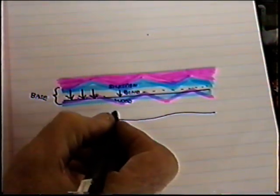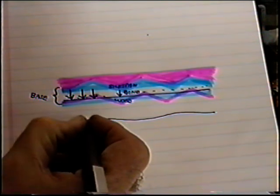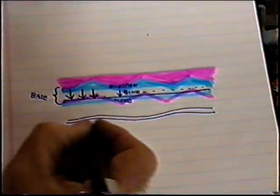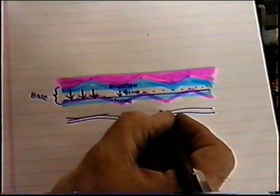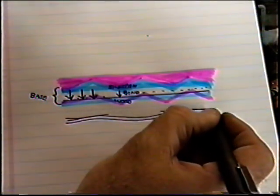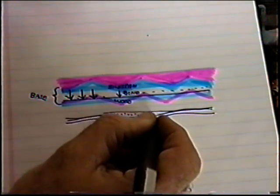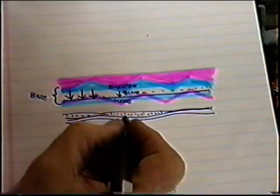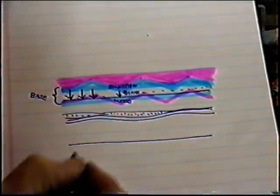So now you've got a few coats of dope on here, and maybe even the silk span, but it's really not as flat as it should be. So from time to time, you're going to want to go back and block sand off the high spots, because if you wait to the very end, you wind up filling all these valleys with filler and putty and red lead and all kinds of materials. And what you really want to wind up with is a flat surface.